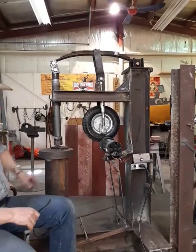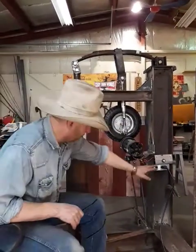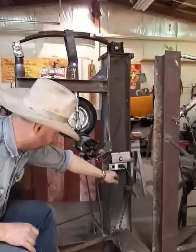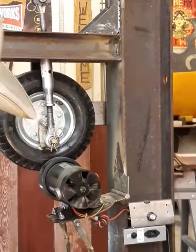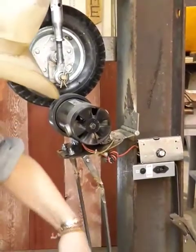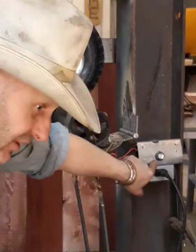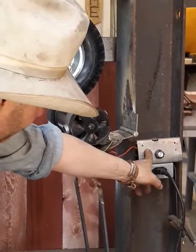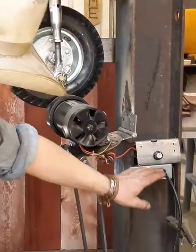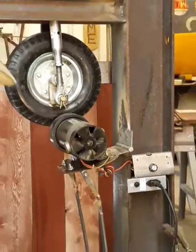You use one of these third arm linkages because you can adjust the stroke. The only real parts I had to wire in were this piece with this 10-amp fuse — this is kind of a dead man. This is actually the cord and the original plug-in that came off the treadmill. Then I wired in a $7 potentiometer I got on eBay, and there's a bridge rectifier in here that changes the 110 into 90-volt DC.